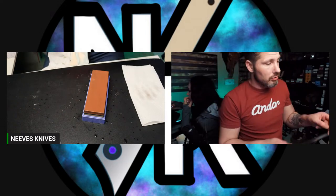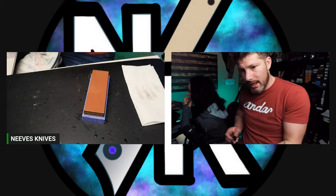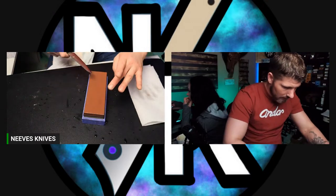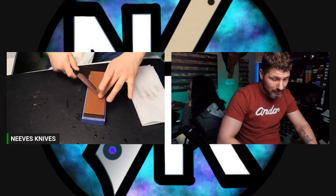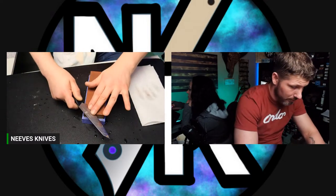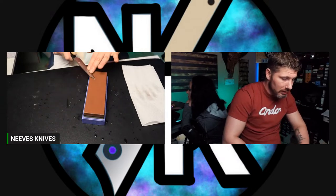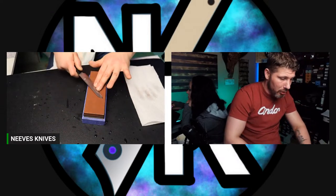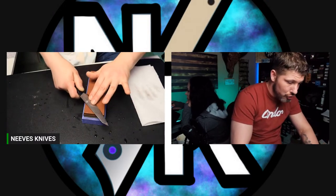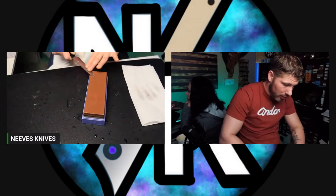Another way is you can cut through paper from heel to tip and make sure it's a nice clean pass. Another way is the paper towel trick, like I just did. Because if you have any burr or chips, nicks, anything like that left on the edge, it will not cut through paper towel. Paper, you can trick a little bit, but it's not going to be super clean, which is going to tell you that you need to spend longer.